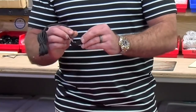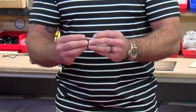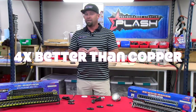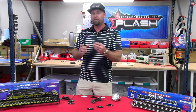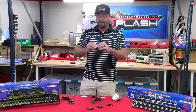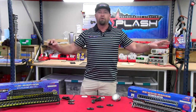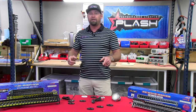Very, very simple, basic design. This back plate is actually made out of the proprietary carbon fiber. This carbon fiber dissipates heat four times better than copper. In the FLIR, it just grabs that heat and breaks it away. What does that mean for this product? It grabs the heat from that LED chip — which can only withstand a certain amount of temperature — and dissipates it away as fast as possible. Overall, that's going to make this chip last longer, make this light last longer, and mean less warranties and an overall more satisfied customer. The goal is to make something in America and make it last as long as possible.